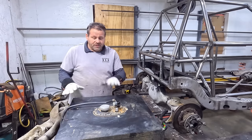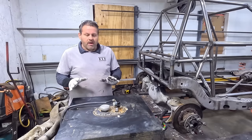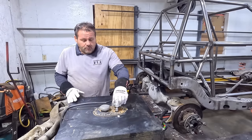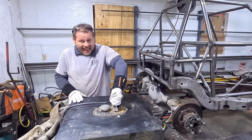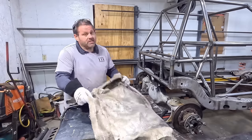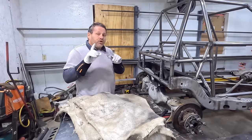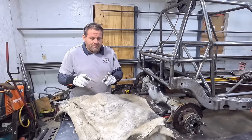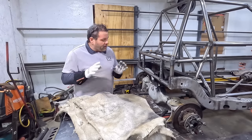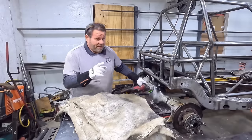This fuel cell has been drained — fuel vapors are dangerous, in fact very dangerous because they can explode instead of just burning. I drained it but then capped it as well. Any time I can use a fire blanket I'm going to, just for extra safety, because I am going to be welding around this fuel cell. Your safety is your responsibility — I've taken precautions to make sure I'm safe working around it. Nonetheless, your safety is your responsibility folks — be careful.